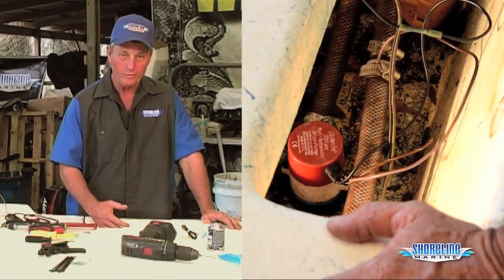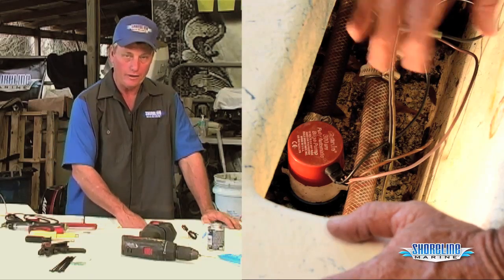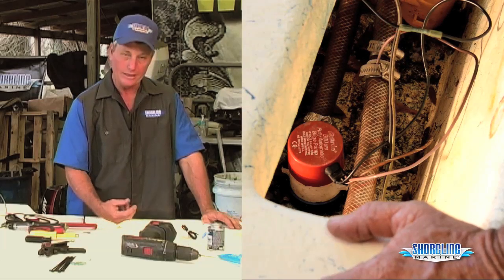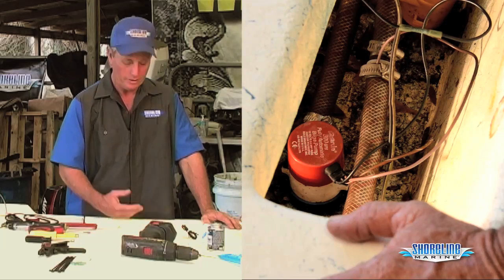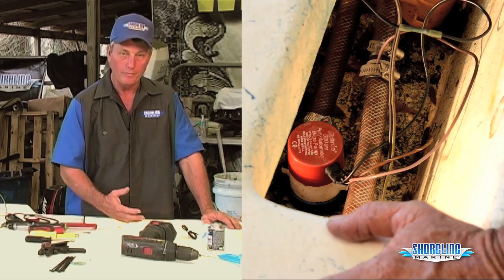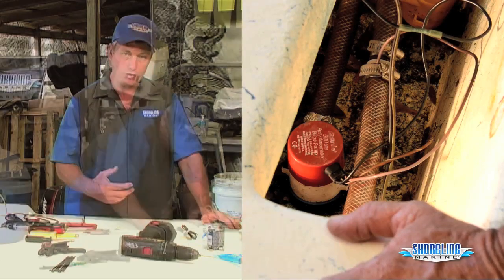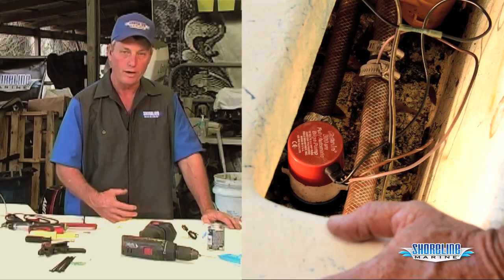One thing I noticed when I was down in the bilge checking out my bilge pump is I've got a lot of leaves and dirt down in the bilge. What'll probably happen to my bilge pump is it's gotten clogged up by the leaves, locked my bilge pump up, melted it down, therefore I have a bad bilge pump. What I need to do once I get the bilge pump out and get ready to install the new one, make sure I vacuum and clean everything up in the bilge so I won't be having this problem again.